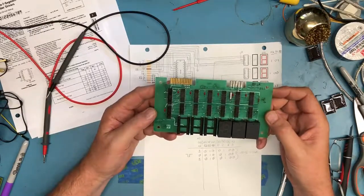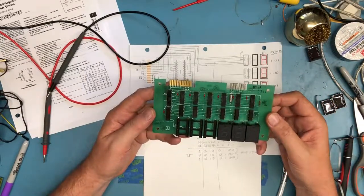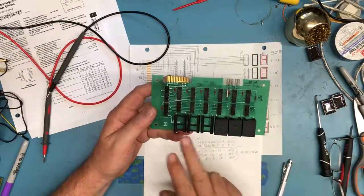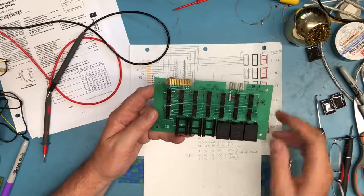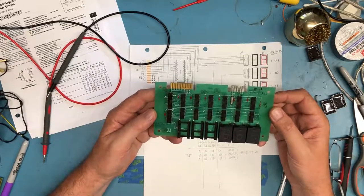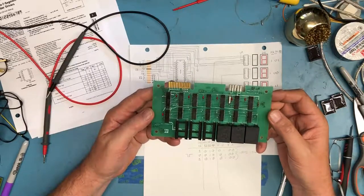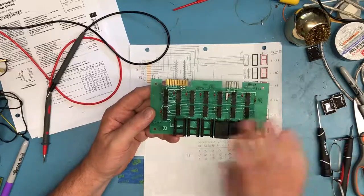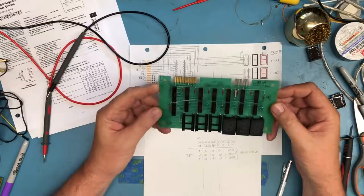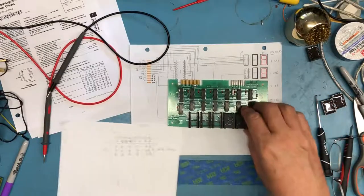So literally as a clock, you would simply need to do a write to this once a second, every time the second changed. Personally, I'd just do a full write cycle every time the seconds changed, for each one of the positions. That would be the easiest to code. That lends itself nicely to a microcontroller with an interrupt occurring off an RTCC once a second. Every time that interrupt occurs, you just write the new time and forget. You now have a full second of processing time in that microcontroller to do whatever the actual application is. So, kind of a neat little board.